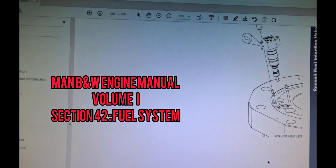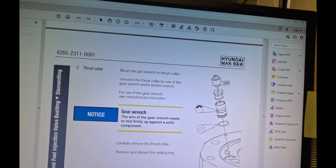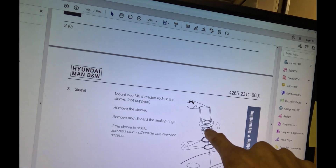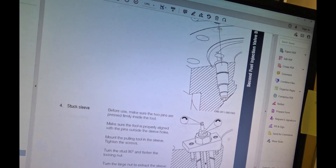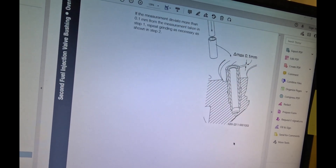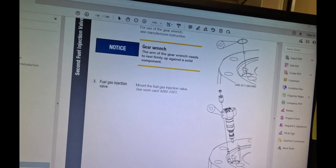So this is the GIV, and as I scroll down — this is what we plan to do. This is the sleeve and the thrust piece that we'll take off. This is the thrust collar, which sits before the sleeve. Gas comes through the cylinder bore, through the sleeve, into the GIV, and straight into the cylinder head through the nozzle. These are the two seals that we'll be replacing. I've read through the manual, my guys have read through the manual, and we've got a copy on our phone. We'll put in the new seal, the new sleeve, the thrust collar, and then the GIV itself.